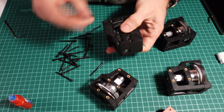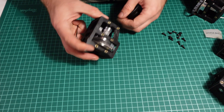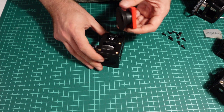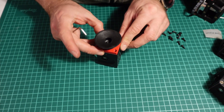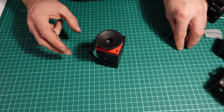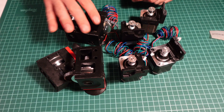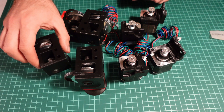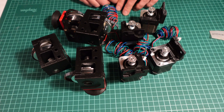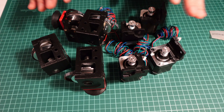When you're done with the belts, put all six screws in and tighten them. When the frame assembly is complete, everything works, and you've locked your pulleys, you can install the legs. This is done by screwing them onto the bottom of the frame with three M3 8mm screws. At this point you should have five fully assembled, freestanding frames and four fully assembled motors, which you will feed into your printer frame — a process I will cover in the next video.